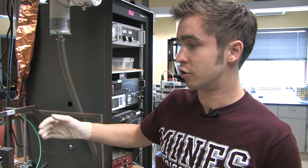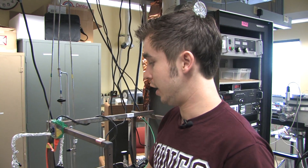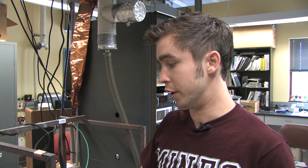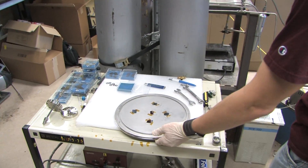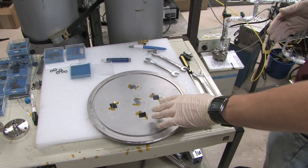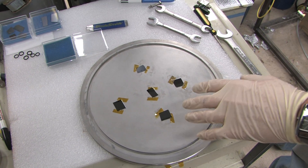We recently tried to change from molybdenum hexafluoride — which is environmentally damaging and very expensive — to a new gas, molybdenum hexacarbonyl. Instead of producing an off-gas of hydrogen fluoride or fluorine free radicals, which are very damaging to the environment, with molybdenum hexacarbonyl we'll be producing either carbon monoxide or carbon dioxide, and it's also a lot cheaper. We can determine the thickness of the deposit using these silicon samples — after deposition, a film forms on these samples and we perform ellipsometry on them to determine the film thickness.